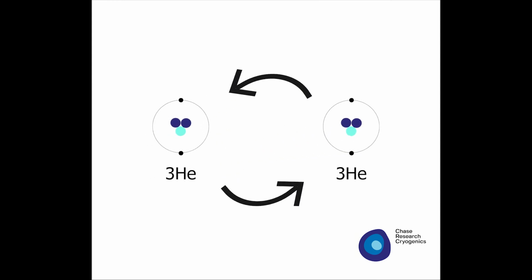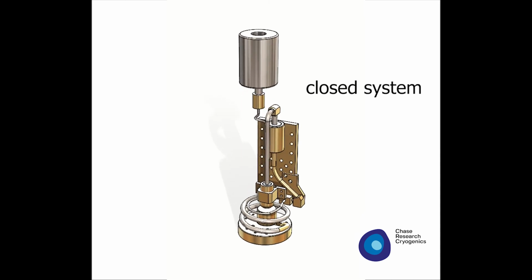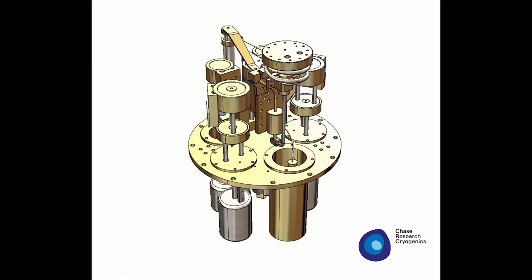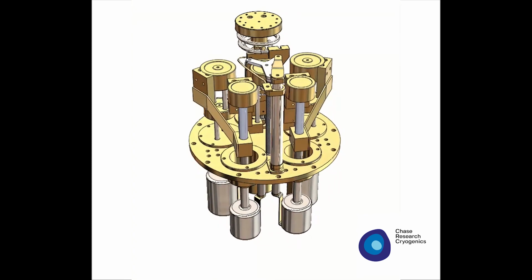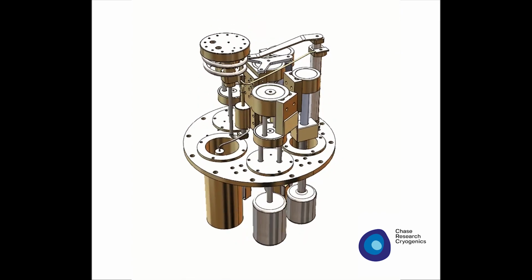In a conventional dilutor, such as the Bluefors system, the circulation is driven externally by pumping helium-3 around the system. This means a lot of cooling power can be gained from the mixing chamber. In this respect, our mini-dilutor is much less powerful, but its small size and self-containment is a big advantage. The entire CC7 plus mini-dilutor can be powered using a small GM cryocooler and a small compressor. It's a mobile system that plugs into your normal wall sockets. The sequence of voltage switching needed to operate the system can be automated and will run as long as you like. It may be small, but it's nifty.